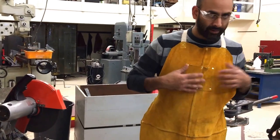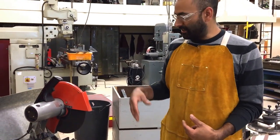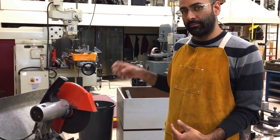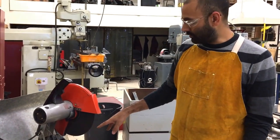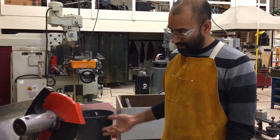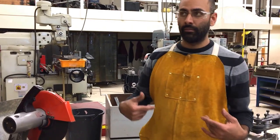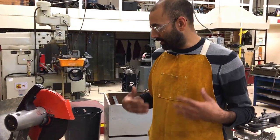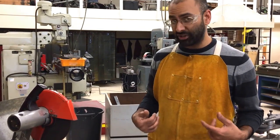It's also the same reason why we're wearing a leather apron. This cowhide leather apron is there to protect us in the event that a piece of metal breaks loose or the abrasive wheel shatters from improper use. If that were to happen, we want to protect our vital organs and our upper legs from being punctured, because injuries to those areas can result in severe injury or even death.